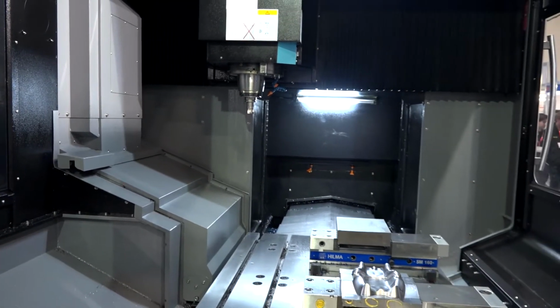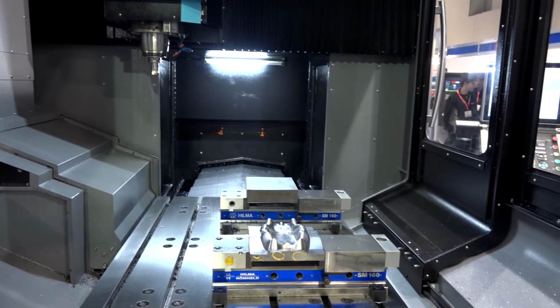So not only application engineers like yourself, but engineers in-house can use it. Yes, that's correct. So Tom, just a quick summary of the Digipas 3500XY. Yeah, so in short, it's a great little level. You set it up, it calibrates really easily. You just run through a little routine. Connect it up to your laptop via Bluetooth, and you've got all the information there in front of you, so you can move the table around and see exactly what the level's doing, move around the machine, especially on some of our large gantry mills.